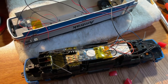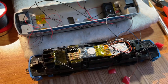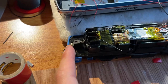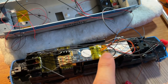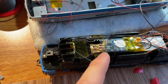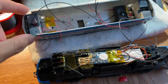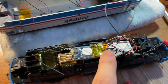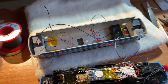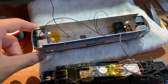About four hours later, working slowly while watching a TV show in the background, this is almost done. I just need to finish the final soldering. I got the headlight, front marker lights, and rear marker lights installed — that handles all four of the front function outputs: headlight, rear light, AUX1, AUX2. Now I'm going to be adding all the accessory function outputs, which will basically be all the lights from the shell — number boards, emergency lights, and strobes — plus the speaker wires.